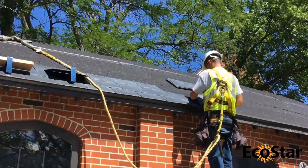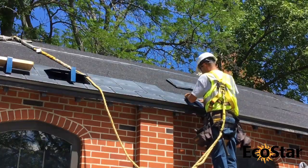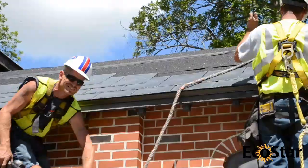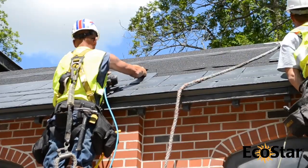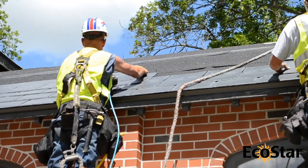A critical step in the installation is bending. Every tile other than Niagara Slate, Niagara Shake, and Shake Plus must be bent in a downward arc before it is applied to the roof deck. Grab the top of the tile, textured side up, and the bottom edge of the tile, and bend the tile in a downward motion until the tile maintains its arc.